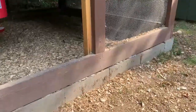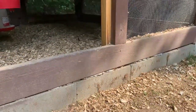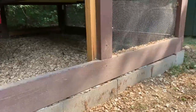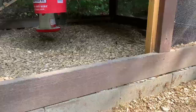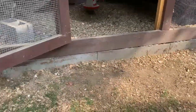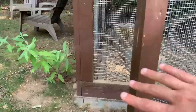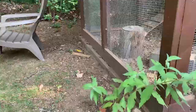To start off, we began with a cinder block foundation. I dug out basically the footprint of the coop, so all these cinder blocks are sunk into the ground several inches. I dug this out so that we could level the ground and our coop would have a level platform to stand on. The basic footprint of this coop is 10 foot by 7 foot.